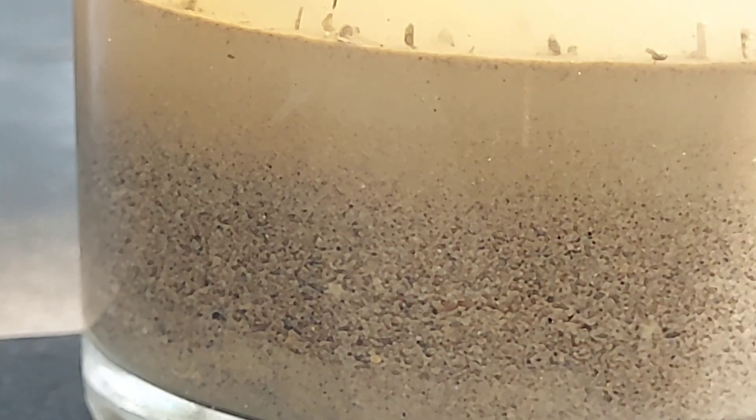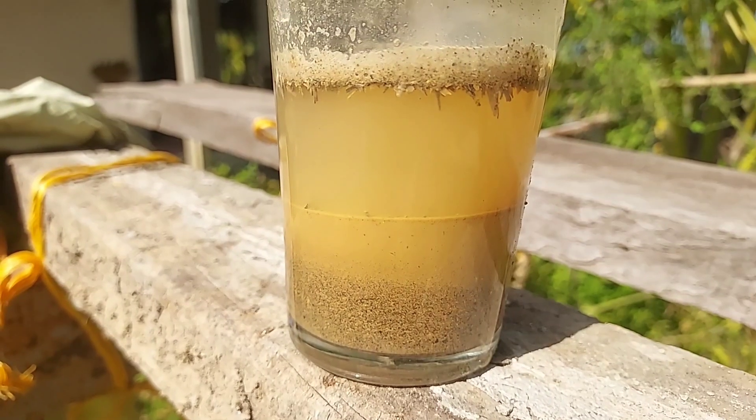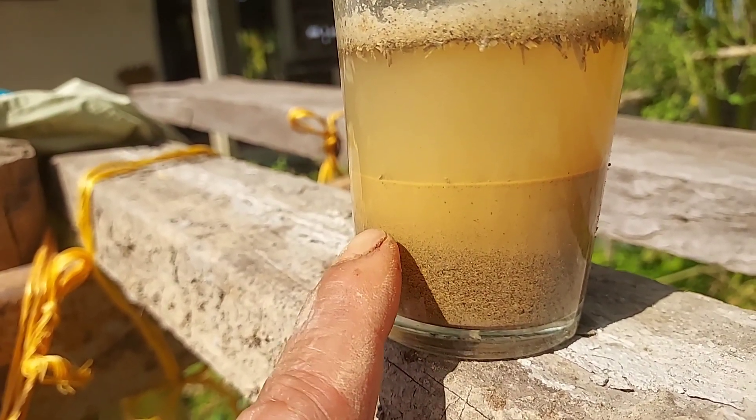So we can see clearly what kind of soil we have and what the components are. It's very important to know this before we build our house. Clay is very fine and settles on top of fine sand because it's very light — it settles later than sand. What we need is clay at least 5% but not more than 40%, and we don't want silt.